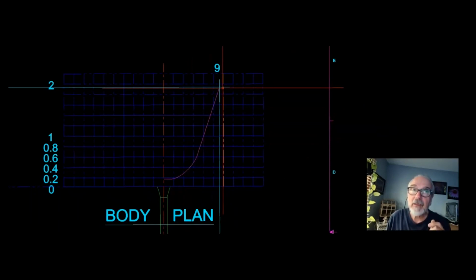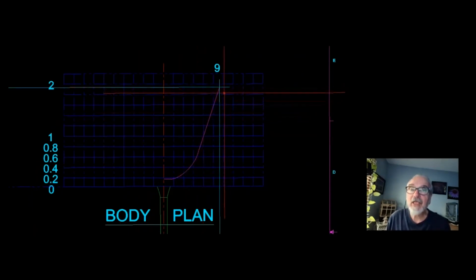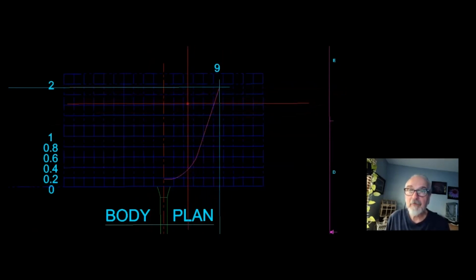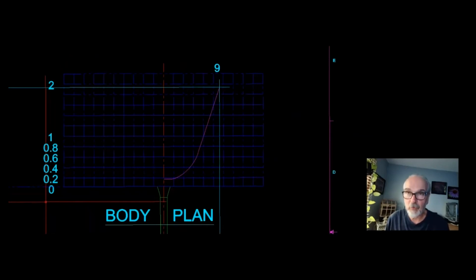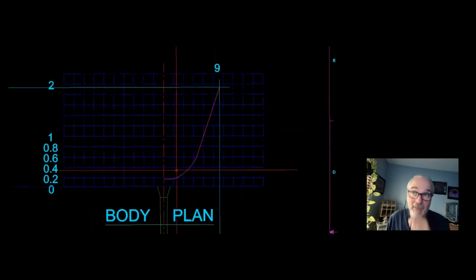If I had the naval architect's drawings, I could do that with a little more accuracy, as accurate as his drawings are. If he did them in CAD, which is computer-aided drafting, which is what you're looking at here, this program, then he should be pretty darn accurate. If he did them with pencil on paper, well, you're as accurate as the thickness of a pencil lead and the, I'm going to call it ruler, but really we call them scales, the scale that you're working with by eye. So some artistic license is allowed to blend these profiles to make them proper.